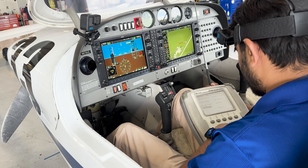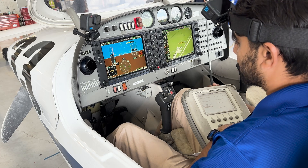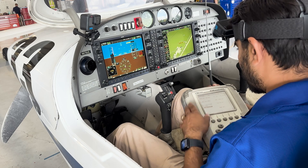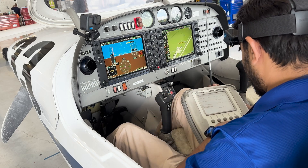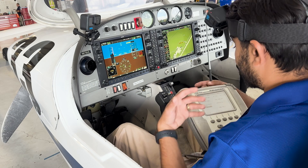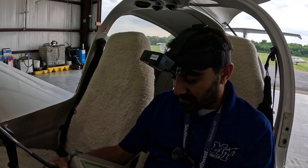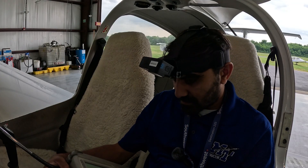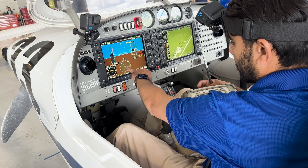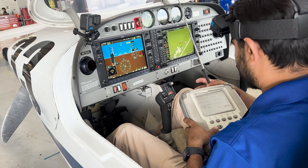I can bring it back to center. I can simulate one dot to the right, two dots to the right, and full deflection — again 12 degrees. I'll bring it back to center. Just like I did with the VOR, I'm going to fail the localizer and see if the aircraft responds the way we expect. I can fail the 90 hertz frequency phase — and I'll bring it back. And the 150 hertz frequency phase — you can see I've lost my CDI. The avionics is telling me it doesn't see a localizer anymore. And back, there's our CDI.